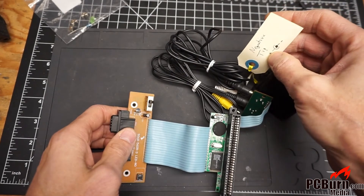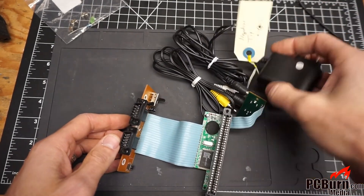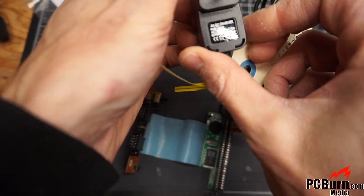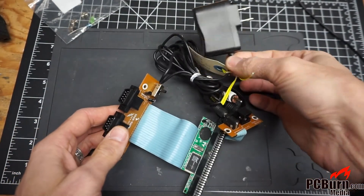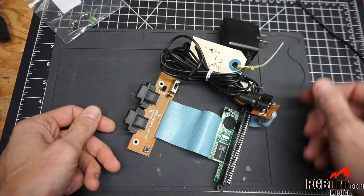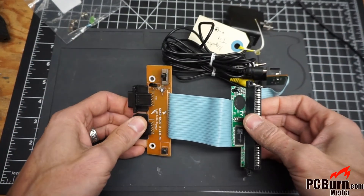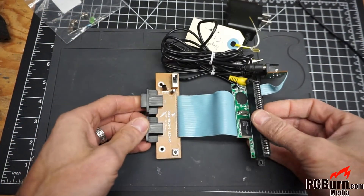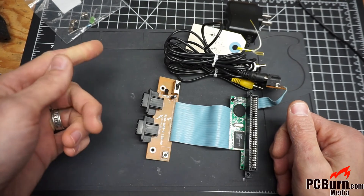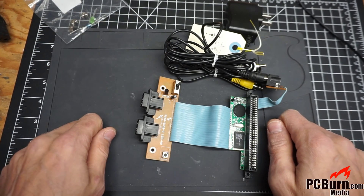One other thing — this little system has a negative tip power supply, so something to be careful of when using these. Just don't replace the power supply willy-nilly. You're going to have to re-pin out a different power supply. I believe these are 9 volts, so it doesn't use much power, but if you do replace the power supply on one of these clone systems, make sure you check what the tip polarity is — this one is negative. You just check it with a multimeter; you can probably find a video on how to do that. I might write something on basic multimeter usage if it's called for. Thanks for watching. If you have any comments or questions, please put them down below in the comment section. If you have any requests, that would be nice, and please subscribe if you enjoyed the video. Till next time.